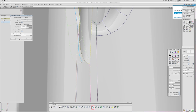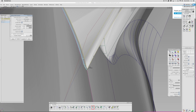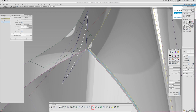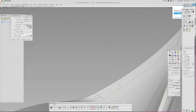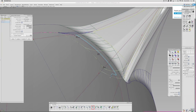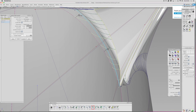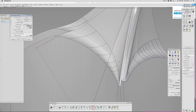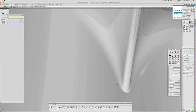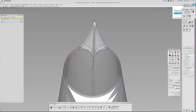I've deleted those surfaces because I'm going to do it on one side and then mirror it. Just making sure everything is the way I want it in terms of the flow control of the fillet, then playing around with that radius. It's getting really small — half a mil — and it's quite happy going up to 12 mil at the other end. Click the white line and type in a value; I've set that to 12 mil and the end to 0.5, so going from half a mil to 12 mil radius. That looks pretty good. Then I select all those surfaces and mirror them over.